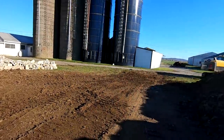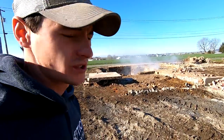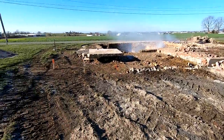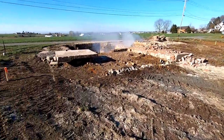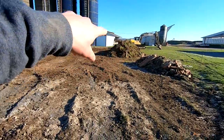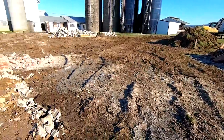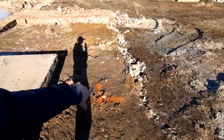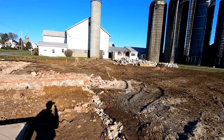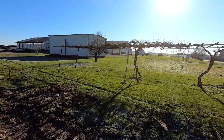It's the next morning. The demo guys got all their stuff cleaned up and were able to keep a lot of wood from the house, which should help reduce demo costs. The builders were here yesterday and we got the new house laid out where we wanted it. We picked the elevation — we didn't have many options because of the drain fields from the old house, which we want to save and need to stay 10 feet from. We also have to be 65 feet from the road. We could go further that direction but I don't want to push closer to the barn or get behind the silos. Sticking it on the other side of the yard didn't really make sense to us.